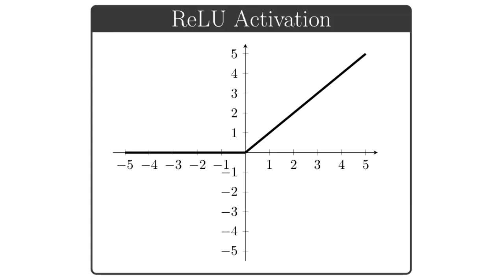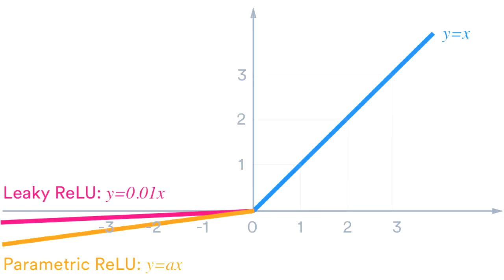When I was training this network, I found around 40-ish percent training accuracy, which isn't great, but it's okay. I think what really gave me trouble was estimating the angle from the IMU readings — there's an arc tangent function that I think the network struggled to replicate. I would also be mindful not to use an activation function that wipes out negative values like ReLU, because the PID output sometimes needs to be negative. Using something like parametric ReLU or leaky ReLU that lets negative values through to some degree worked a lot better.